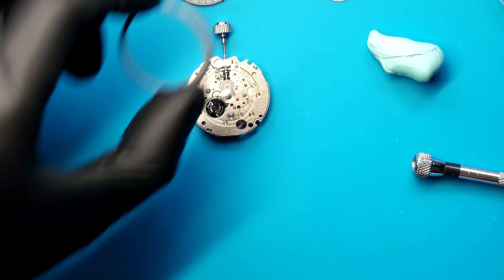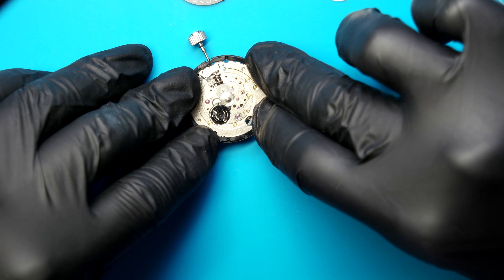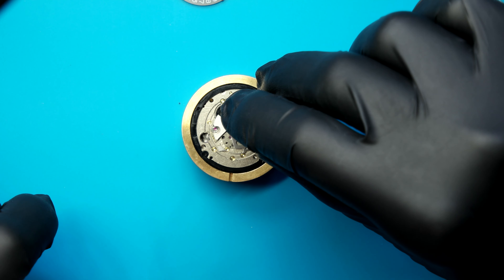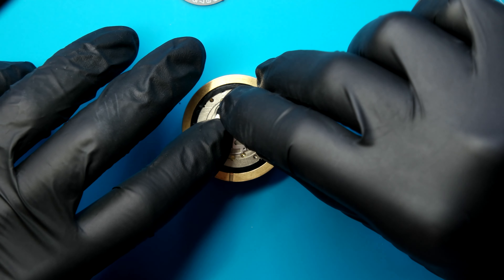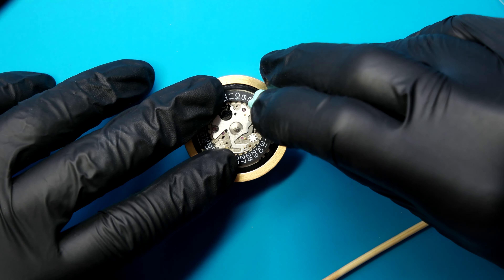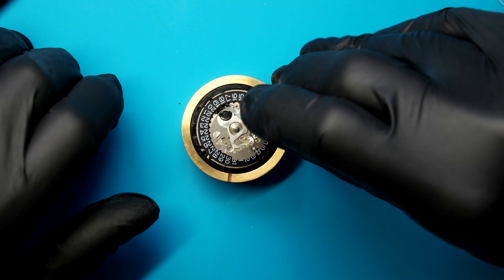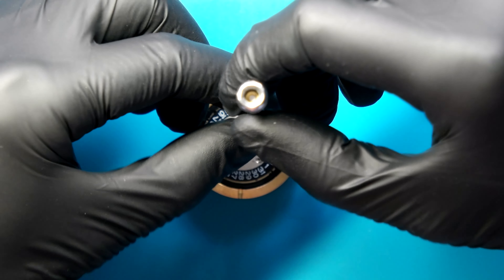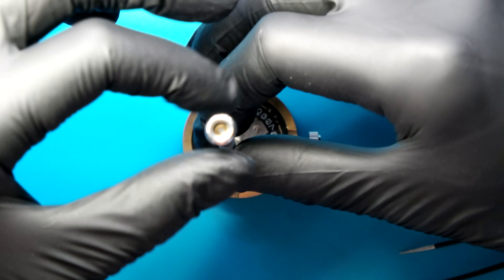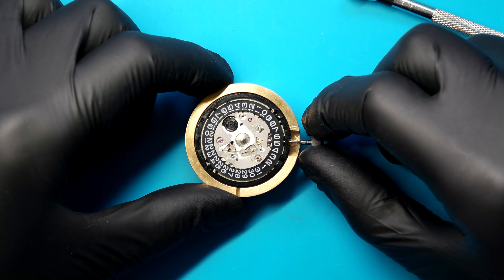Once it's come up all the way around, we lift that off and put it to one side. Then we get the black spacer from the 7S36C, line it up with the holes the dial feet would go through, and gently press it down into place until you hear the plastic snap around the movement. Then we pop it back in the movement holder, ready to set the date disc components back on, starting with the little metal plate — making sure the two pins stick up through the holes to keep it aligned. I like to lift the date disc into place with a piece of Rodico and hold down the plate with a toothpick so as not to scratch it, then apply a little pressure with my fingers and rotate until the date disc snaps into place. Then I put two screws in to make sure the gear goes down and functions correctly, because I've had issues before where gears get stuck on each other. As you can see it doesn't do anything when I turn it this way because there's no day disc, but when I turn it backwards the date is functioning just fine.